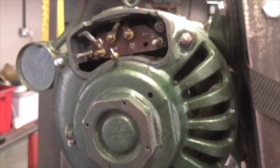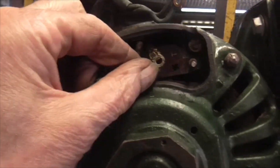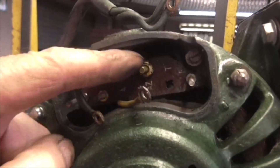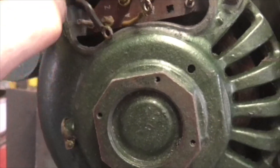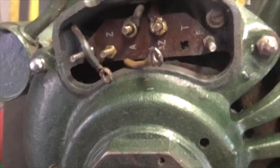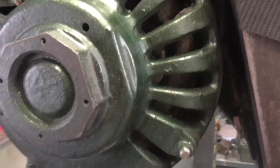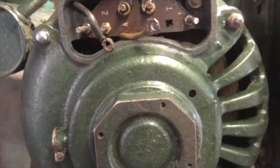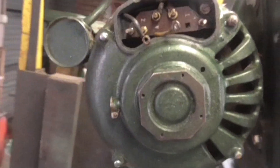Right folks, we're in. This was the one connected to Z and that was connected to AZ. I've tested these two and they're a winding, and those two up there are a winding - that's the run winding, this is the start winding. I need to put that one onto there and that one onto there to reverse the motor. But I've looked inside this motor and it's filthy. I'm going to drop this end cover off and service the centrifugal switch because it's covered in grease and muck, and it gives a big flash every time it opens and closes.